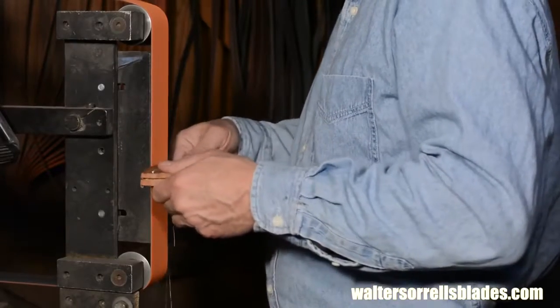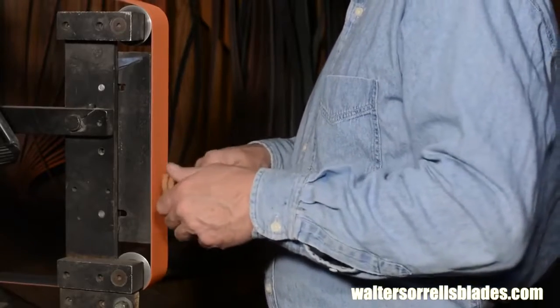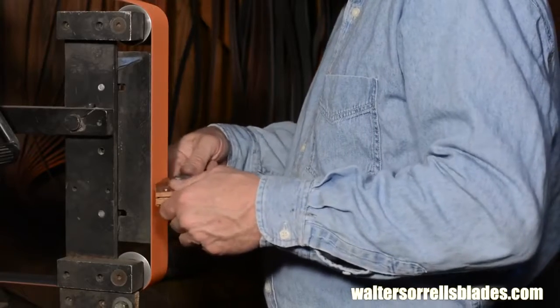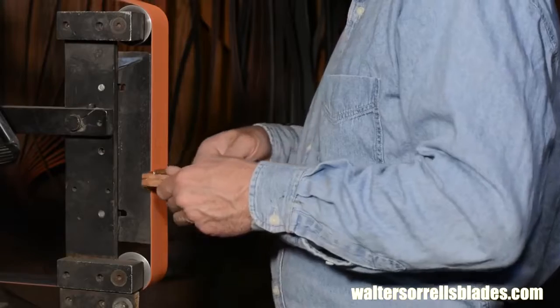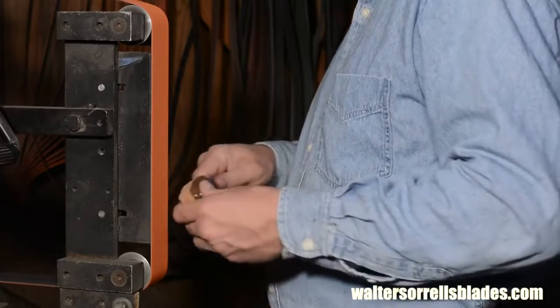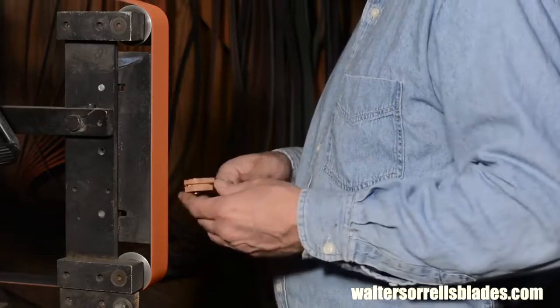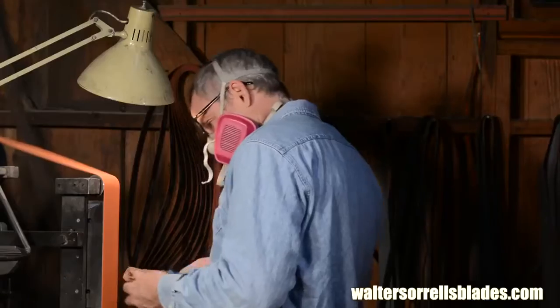Again, I'll start with the 40 grit belt, grinding all around the knife so as not to heat any particular piece too much. First, I just eliminate all the excess pin and bolster and thong tube material. Once that's over with, here's a very important point. Be aware when grinding handles with metal pieces in them that wood grinds way faster than steel. Of course, you already knew this, but here's the practical result.